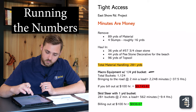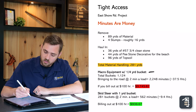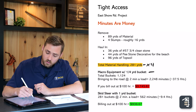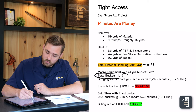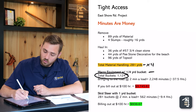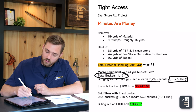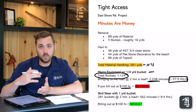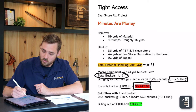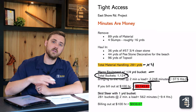Let's run through these numbers. With macro equipment using a quarter-yard bucket, we need a total of 1,124 buckets — 281 yards times four, because there are four quarters in a full yard. If it took us two minutes to get from the top side of the project down to the bottom, that would be 2,248 minutes, which is a total of 37.5 hours. Billing out at $100 an hour — put your number in whether it's 80, 90, 60, whatever — that comes out to $3,745.67 to run a macro piece of equipment on this project for material hauling.